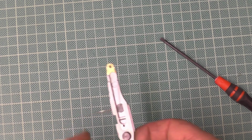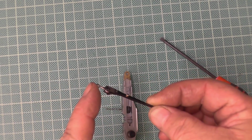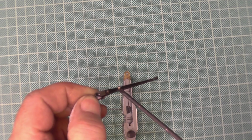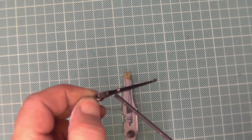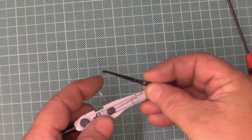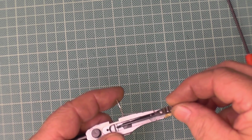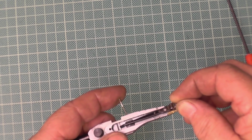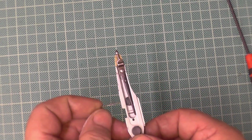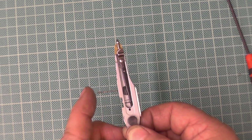Now what that spring works on is this little lever here. That's the stylus at the front, so obviously that goes to the front. On the back, there's a peg, and in that peg there's a hole, and that goes onto, a bit fiddly, so I'm working to camera, not the eyesight. Right. That spring goes into that little peg with a hole in, so when you move your lever, the opposite end goes up and down.